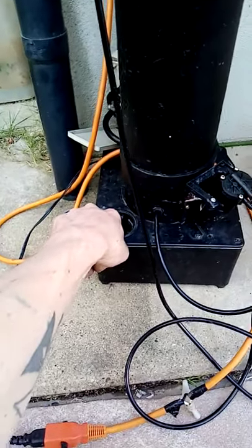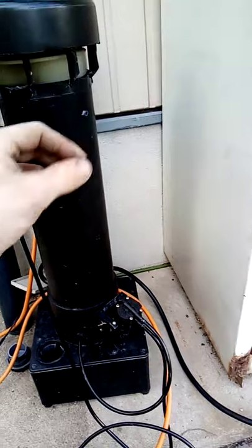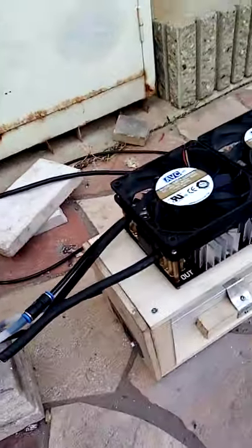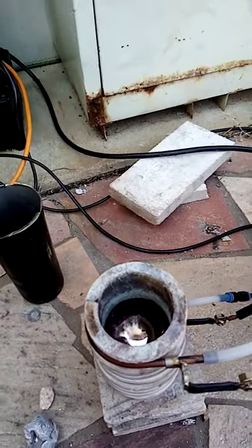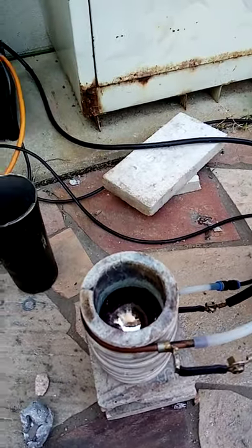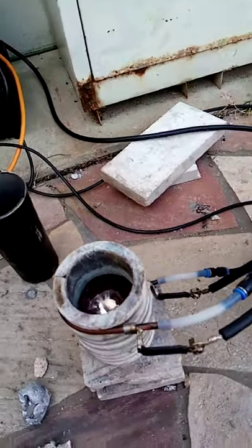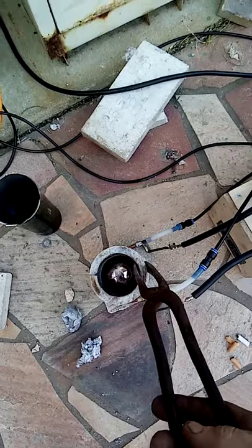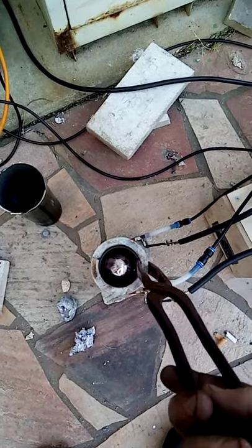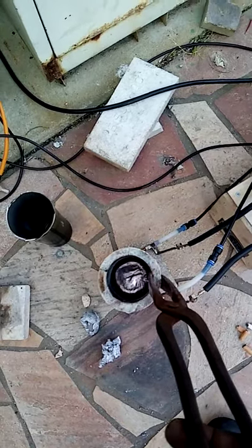It just keeps the coil cool. Right now it's just warm even though I melted those blocks — the water is just warm, I'm putting my finger inside right now so you can tell it's not very hot. The cooling tower works fantastically. If you put your hand here you can feel little water droplets coming out because it's dissipating the heat so fast. I've already melted copper and brass in this same crucible — you shouldn't mix crucibles because then you get contaminants inside the metals.